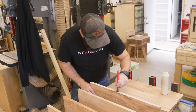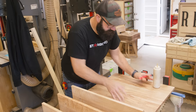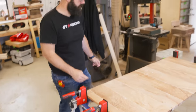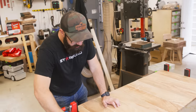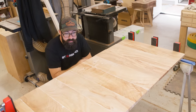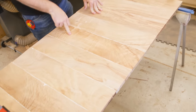I want to get these nice and coated — I don't want oversaturated joints, but I definitely don't want starving joints either. I want some nice squeeze-out coming out of here. I'm not really wrenching on these clamps; they don't need to be Godzilla mode tight, because that puts pressure in the center and things can start to come up and move around. You just need enough to get squeeze-out. I want to make sure nothing's raised up so I don't have unevenness to fix later. Everything's staying perfectly flat and I'm getting really good squeeze-out everywhere.